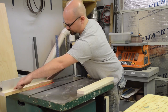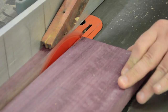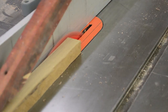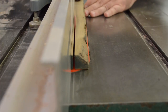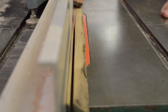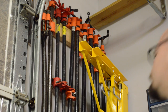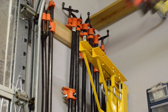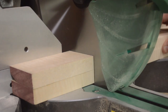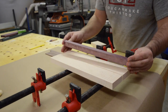After jointing, I rip the pieces to width at the table saw with a ripping blade. For my design, I ripped my maple board in half, the purple heart at around five-eighths of an inch, and two sets of thin walnut strips — one around three-sixteenths and the other just over an eighth of an inch. I didn't clean these down to thickness now because I'm going to plane everything after the glue-up anyway.